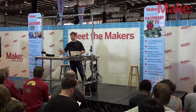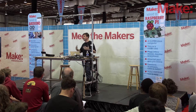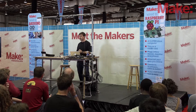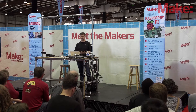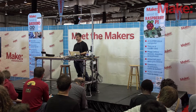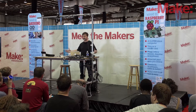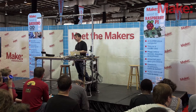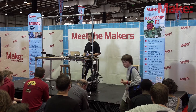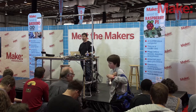I'm going to be using the Arduino Uno and a couple of phones here, and we want to be sending data back and forth between the two. There are a bunch of ways we can do that, but one of the ways is Bluetooth. Bluetooth works well if your computer or your phone has Bluetooth, which most do, and you're going to be in close proximity to the device, because Bluetooth is only about 30 feet. We're going to start off with Bluetooth Classic, which has been around for a long time.